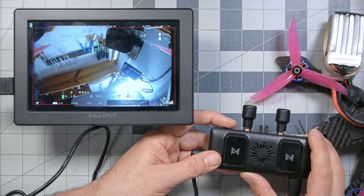The other thing you need to know is that the goggles were displaying a latency of 30 to 32 milliseconds for pretty much all of these tests. And that's the latency that you expect to see and that they advertise for the 60 FPS low frame rate mode. But the numbers that we're going to see are higher than that. And the question we're going to tackle is, is the Fat Shark HDO or the Orqa adding additional latency compared to the Dominator? Does that have something to do with the HDMI output on the VRX? Or is it that they're just not reporting accurate numbers?